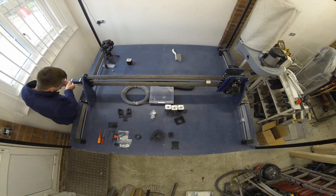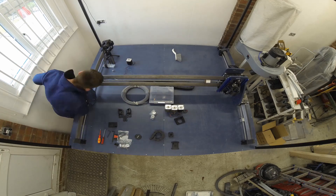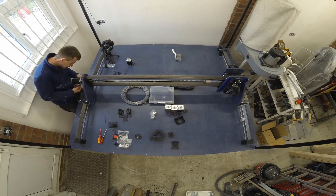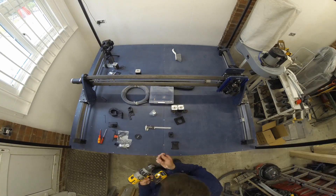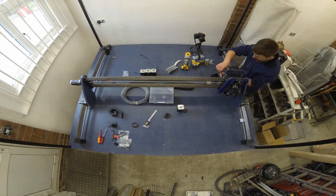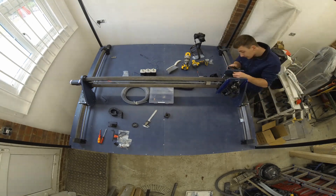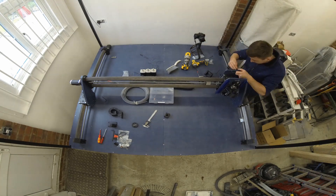You can see me take the x-axis motor off again. I brought the same motors that were used on the Root 3 CNC machine, however because this design is a ball screw one, the RPM of the motors need to spin much higher than that of Root 3 to get the same sort of travel speeds. Unfortunately the low current motors used on Root 3 were no longer suitable for this Root 4, so I had to buy a completely different set.